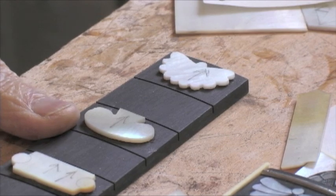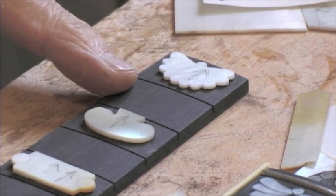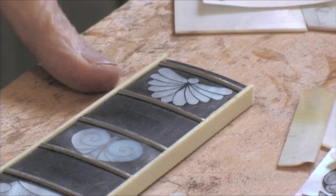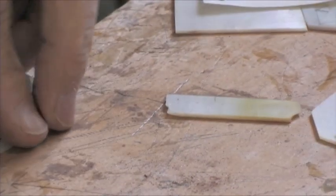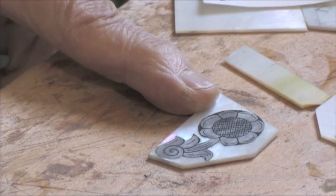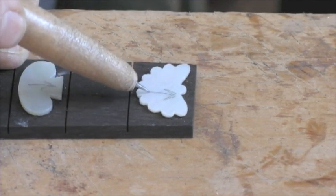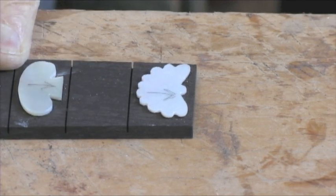Today I'm going to go through the action of actually taking these off, leaving the scribe line, and then the Dremel tool will route this out so the piece fits perfectly down in there. Here's a fingerboard that has already been inlaid and engraved — you can see these things come alive after they're engraved. Here's another piece with an inlay from an old banjo. I took a picture of the banjo neck at Kinko's Copies, cut it out, and pasted it on a piece of pearl to cut out later. You notice I've got an arrow pointing straight up — that tells me to put this back in the same place once I take it off.